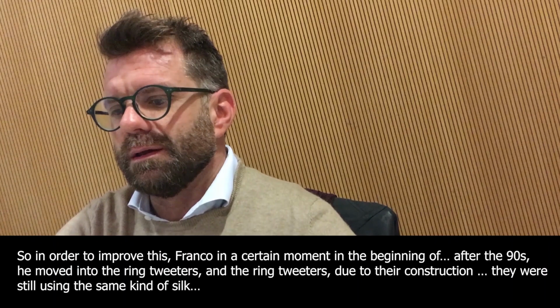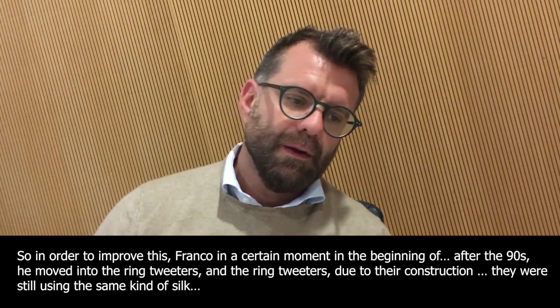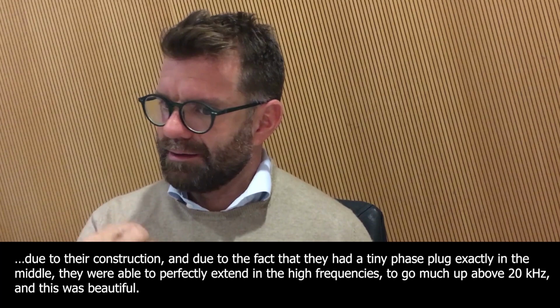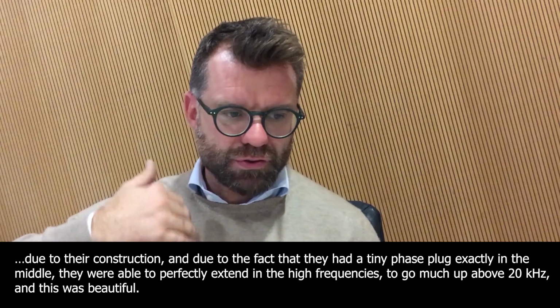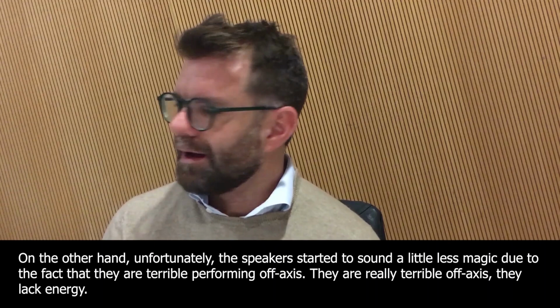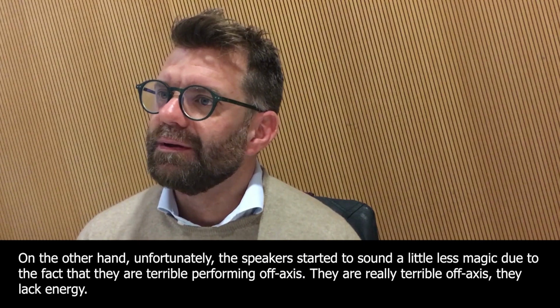So, in order to improve this, Franco, at the beginning of after the 90s, moved into ring tweeters. The ring tweeters were still using the same kind of silk. Due to their construction, and due to a tiny phase plug exactly in the middle, they were able to perfectly extend in the high frequencies, going much above 20K. And this was beautiful. On the other hand, unfortunately, the speakers started to sound a little bit less magic, due to the fact that they perform terribly off axis. They're really terrible off axis. They lack energy.